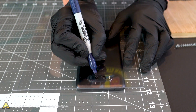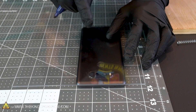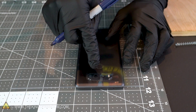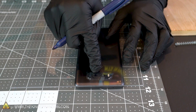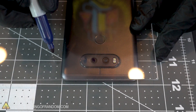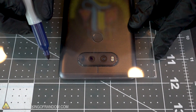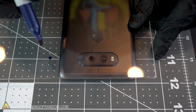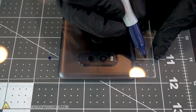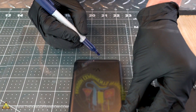Using a marker that will draw on the plastic, mark a spot where your phone's camera is. This model of phone has two cameras on the back, so I'm making sure to mark the one that's used for narrower shots, not the wide-angle lens. In line with where you've marked your camera, mark two spots on the sides where you can add your supports. You'll be drilling holes into the plastic about one quarter of an inch wide, so make sure you leave enough space. Add one more support point down near the bottom of the phone as well.